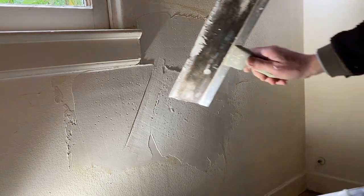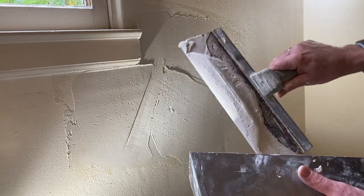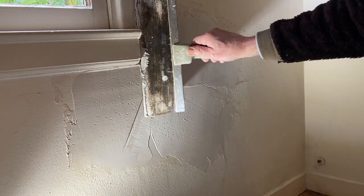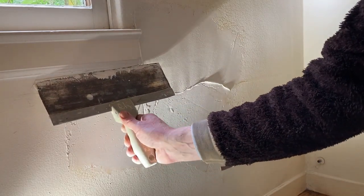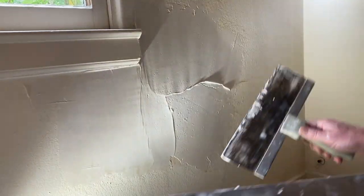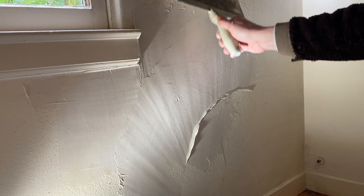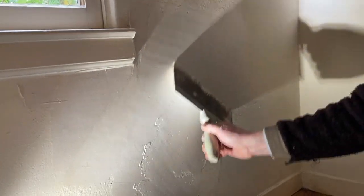We're floating, right? We're trying to bury. You see, what's my knife look like? Something like that. Trying to float this sucker, right? English up here, press harder there, right? A couple times it takes. Okay. Maybe we try it like this. Press harder on that side. Oh, that's looking good, right? Okay, so now this area, how are we gonna do it? Okay, here we go. We're floating. I'm not pressing that hard. Floating, right? Trying to bury these suckers. Bury that tape.